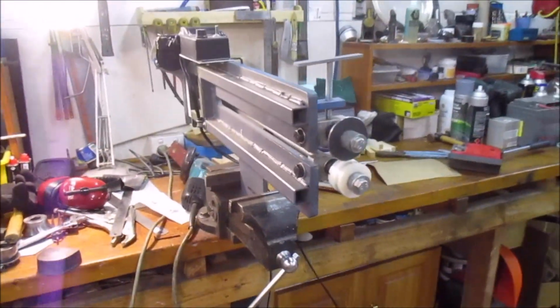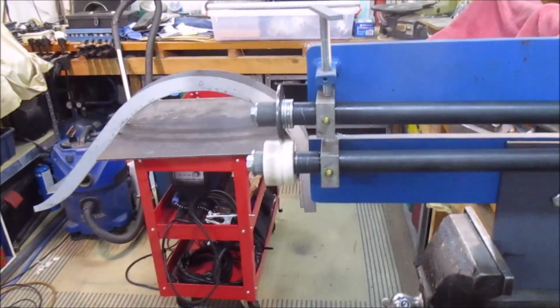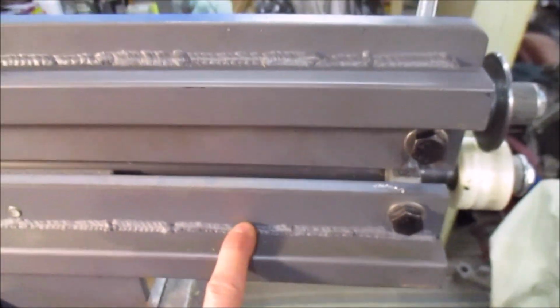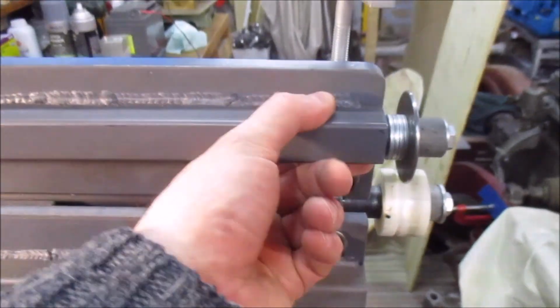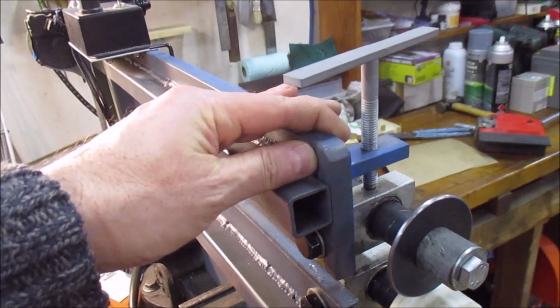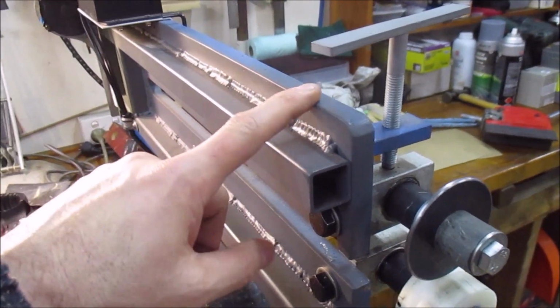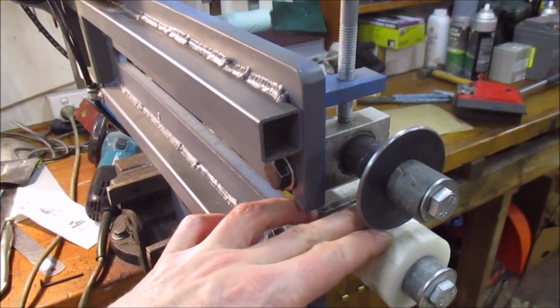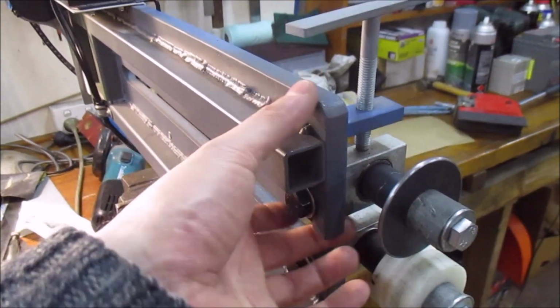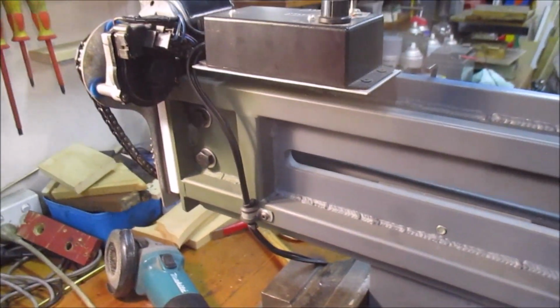If not, I'll have to hammer it flat. I did have to turn the bead roller around in the vise, because those panels are so long. When you're trying to roll them, they have to roll through and curve around. But that worked fine. You can also see just on the back of the bead roller here where I welded on stiffening bars. This is made from, I think it's about 12mm thick steel plate, but it's not rigid enough. Just with the plate that it comes with, it will actually warp. You can see it even when you put thin metal in here. If you really clamp down on it, you can see all this twisting. So I strengthened it up with these box sections, which seem to have helped.